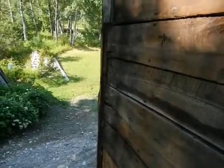Okay, and we worked upstairs and outside. We were pulling siding. So you can see from here, we have lots of light showing through. TC ordered our house wrap today, and it's not supposed to rain until Friday or Saturday, but we've pulled off. This actually looks like it's in pretty good condition. Nothing feels rotten. It was solid, but I wasn't personally pulling it off. Oh, that's good. We have some rottenness down there on the corner.